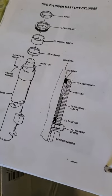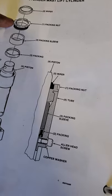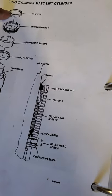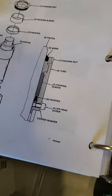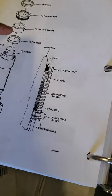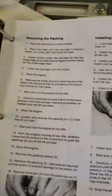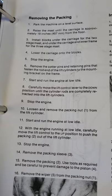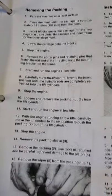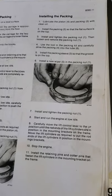This is a diagram in the book that shows what I'm removing. I was removing the packing nut. You can see the wiper bulging out — or it blew out. Then I'll have to take the packing sleeve out and the packing. Over here are the instructions for removing the packing, and here are the instructions for installing the packing.